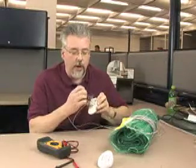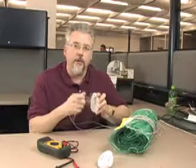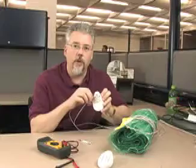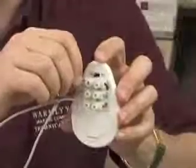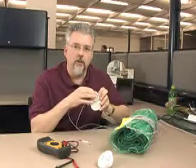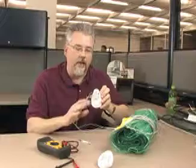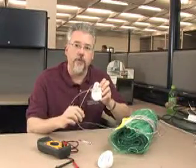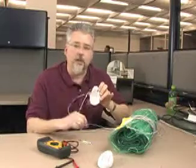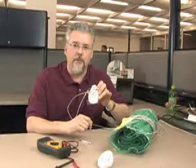Now I'm going to replicate what will happen sometimes in the field if you nick the wire with your trowel or damage it with a shoe or a tool falling on it. If you hear this noise in the middle of your installation, that tells you to immediately stop what you're doing, go back, and investigate what just happened. Verify that your connections are good on your circuit check, and if they are good, then whatever you were just doing to make the circuit check go off is an area on the mat that you want to inspect to make sure you did not damage it.